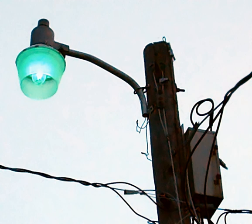One of the original complaints against mercury lights was they tended to make people look like bloodless corpses because of the lack of light from the red end of the spectrum. A common method of correcting this problem before phosphors were used was to operate the mercury lamp in conjunction with an incandescent lamp. There is also an increase in red color, e.g., due to the continuous radiation in ultra-high-pressure mercury vapor lamps, usually greater than 200 atmospheres, which has found application in modern compact projection devices. When outside, coated or color-corrected lamps can usually be identified by a blue halo around the light being given off.